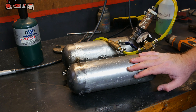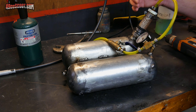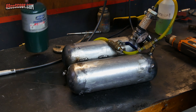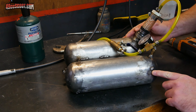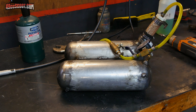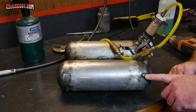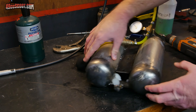I started changing things up — using about double the heat I normally would in the welder. That seemed to help a little bit. Also, before each weld I'd fire up the propane torch and heat that area for maybe 10 to 20 seconds — I could see moisture evaporating even after I had cleaned it. And I gave up on grinding some of these areas down. Right now it's sealed. There's one area with a big nasty bulge because I burned all the way through cranking it up to double the heat — made about a quarter to three-eighths inch hole and had to patch it. But everything I've found aside from the pickup tube is now sealed.